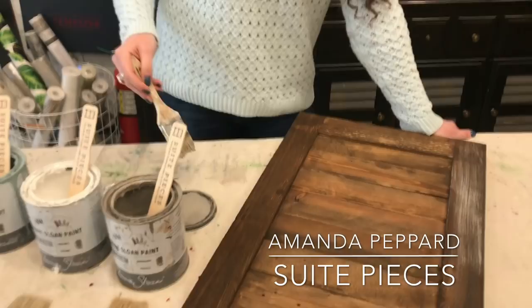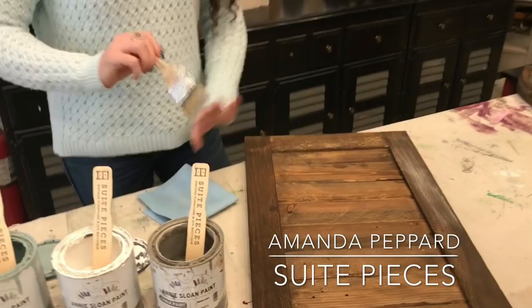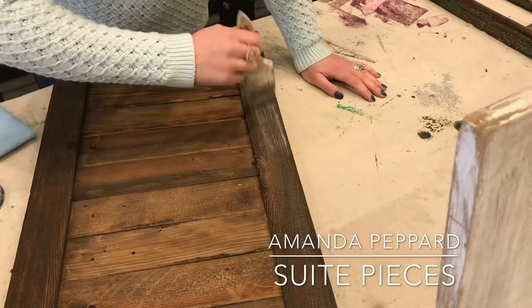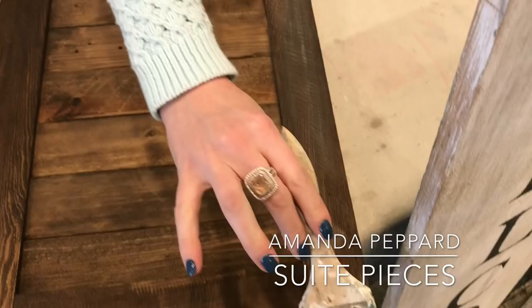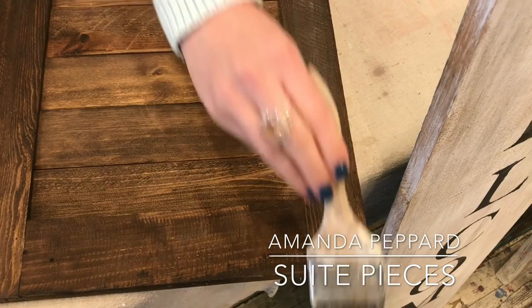I have a drop cloth here, but if you don't have that at home, use a towel — you don't want to do it on your table. These are our chalk towels, my favorite rags to use while waxing. Then when I go to put this on, the key thing is to be very light-handed. I am barely touching my brush onto the surface — that's really the key. Where people get really messed up is when you jab your brush down and wipe. You want to almost start off the board and just gently let the brush kiss on the edge. When you don't see any more paint, then obviously you need to add a little bit more. So again, I'm starting off on the edge, letting this come on very, very lightly.